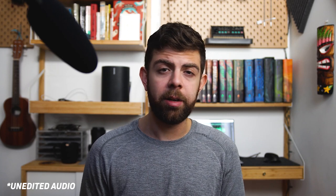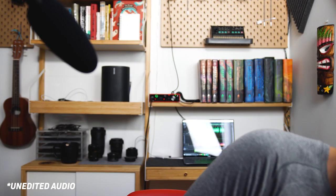Another example is the Sennheiser MKE 600 shotgun microphone. This has a super cardioid polar pattern, which means it can pick up sounds directly in front of it and from pretty far away compared to the Rode. Right now it's pointed directly at me and you can hear that I sound pretty good. But as I go off to the side or over to the other side, you can hear my voice drops off considerably. Shotgun mics are pretty directional and good at not picking up sounds that are off axis. Knowing the polar pattern of your microphone is really important and we have a full explainer in the description.